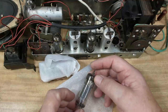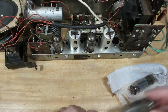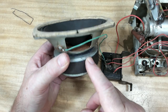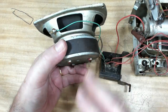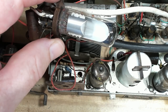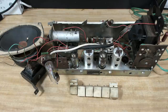The missing valves are the output valve - an EL82 - and what should be an EZ80 rectifier, equivalent to a 6V4. There's also a floating wire - I think it's off the output transformer, probably negative feedback. This is the EM80 magic eye, and it actually looks brand new inside - Blitz mentioned it was low-hour. This wire with the melted insulation is the return from the transformer, so there's obviously a high-current draw item - probably a capacitor. I'll pull out the schematic.